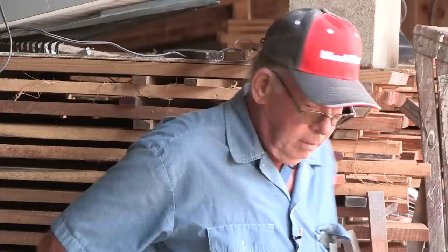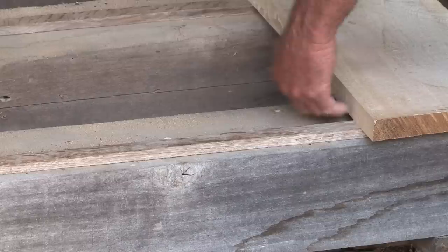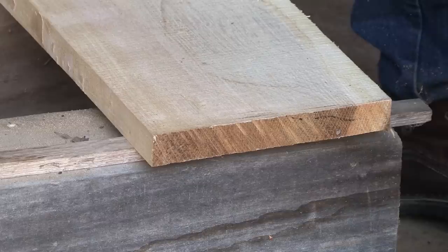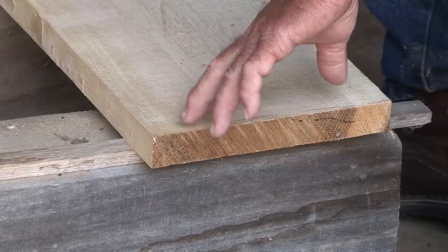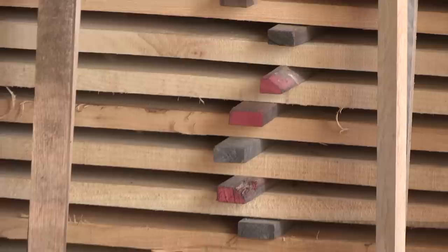There's also a little bit of science to stacking your pile. You want to keep the stickers — even if a dry piece of wood is up against a wet board, actually put a sticker underneath there so you get air down through there. And these boards should be as close to the ends of the stickers as possible; that prevents deep end checking. Or better yet, the ends could be coated with a wax coating to slow down drying from the end, because boards dry faster out the ends and that causes them to shrink and crack or check.